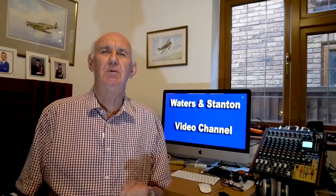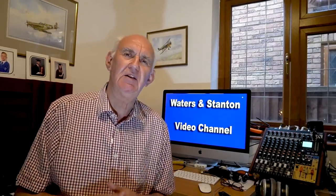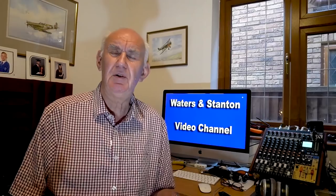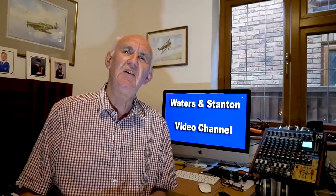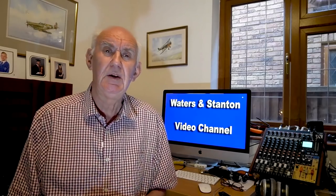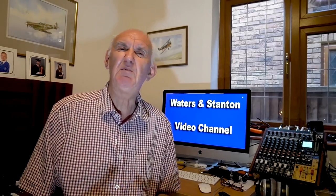If you're looking for a low VSWR all the way along, you're going to get into a state of depression, because I don't think it's going to happen. But it doesn't actually matter. There are times in radio when there's a psychological point that says 'I've got a high SWR and it's not right.' Well, sometimes you can have a high SWR — when I say high, I mean 3, 4, 5 to 1. If you understand why you've got it and appreciate that on a short length of cable it makes no difference, then just live with it. That modest VSWR is something that the internal ATU of your transceiver takes care of — it's one of the reasons it's there.